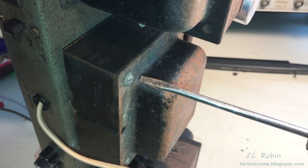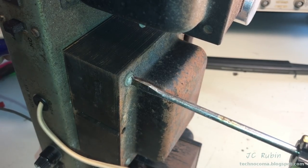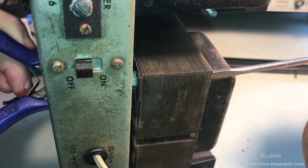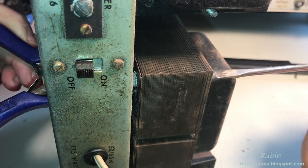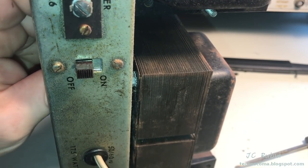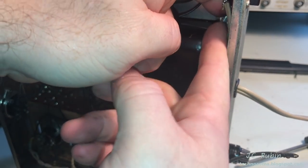Nothing relatively special about the removal. It's flathead, securing the nut from the bottom. There is an intermediary nut as well as a standoff. And we could see that one spinning. That's the one that actually holds the transformer together, but we're not really concerned about that one. We just want the transformer out of the unit itself. Once you get a few turns on it, though, you can just remove the nut from the bottom. You needn't turn the screw from the top, such as this. Then the lock washer way back there.